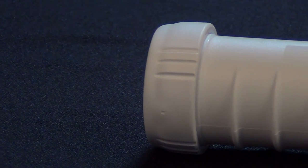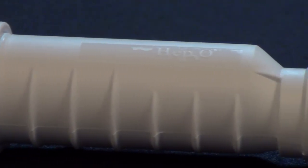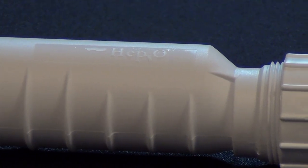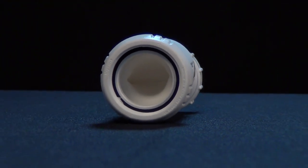It's called the HEPVO Sanitary Waste Valve — not a P-trap, but a one-way valve that allows water to drain, and once the water flow stops, it prohibits sewer odors from coming into the RV from the gray holding tanks. The number one complaint from RVers everywhere is obnoxious sewer odors inside the RV. The secret is the unique design of the internal membrane that fully closes shut when the water flow stops.